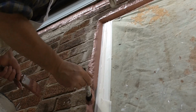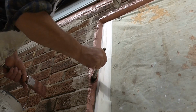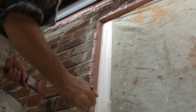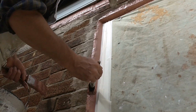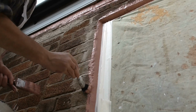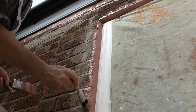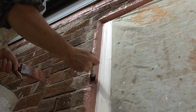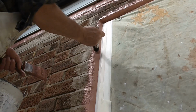Like I said, it's getting 3 coats, so you can build up, you can check it over, fill little bits in. And you can straighten that edge, you know, on the 2nd coat and then on the 3rd coat. By the time you've finished it, it'll look really neat, that.